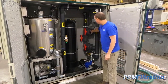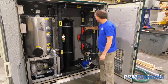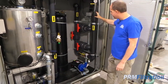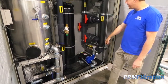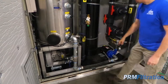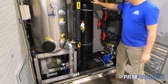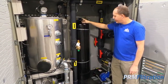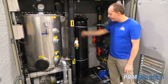This unit has a carbon bypass built in. The customer can either vent directly out to atmosphere or valve it to go through a set of carbons. There's also a moisture knockout tank pump, so if they do collect more water into the knockout tank, the float system will allow the pumps to pump through the carbon vessel — a liquid phase carbon vessel — and they can be sampled and then out to discharge.